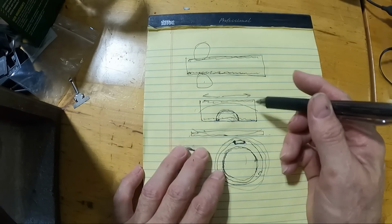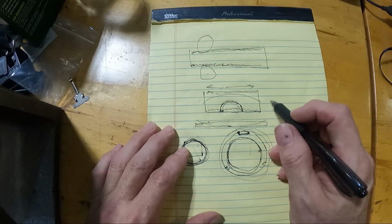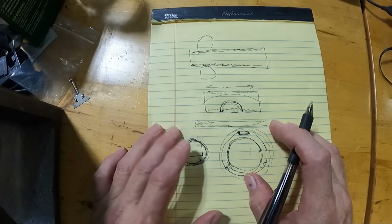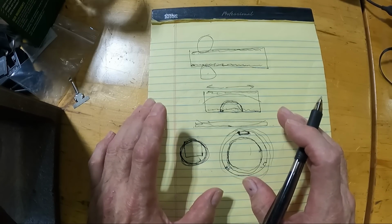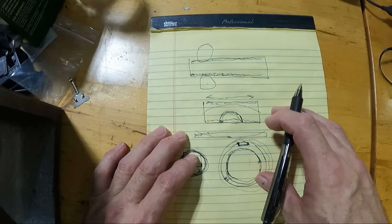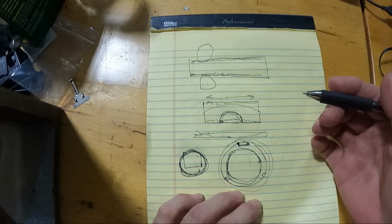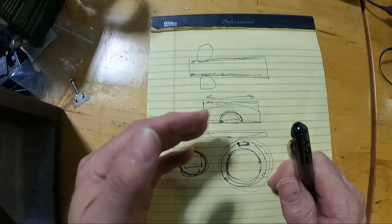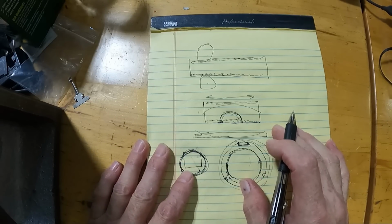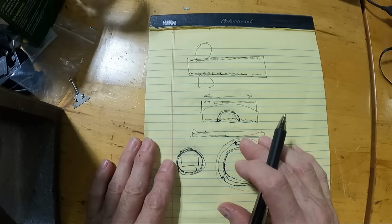But most of the time it has to do with the way the material is manufactured and maybe subsequently heat treated. Now, there are often a lot of comments on videos saying, oh, you can send it to be stress relieved, and yes, you can do those things if you're able to. But in a modern machine shop nowadays, you have certified materials, so you have all these certifications to get around. You can't just send something to the heat treat place without having the whole batch of material retested. You have to have a test sample and tests done. It's very expensive and takes time, and you have to have the customer's permission, because you're changing the certification on the material that was purchased for the job.